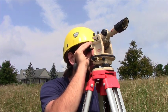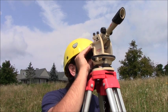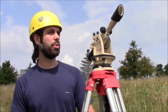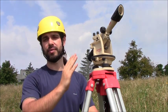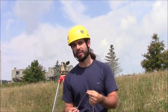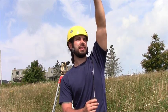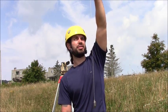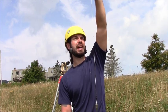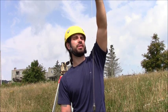At the 20-foot guy wire level, we're just a little bit off center past vertical, and the tower continues to move in that direction. So we're going to have to pull in some slack on our rear guy wires to pull the tower back into a vertical position. In a situation where you don't have a transit, you can use a plumb bob, which is basically just a weight on the bottom of a string. Set yourself up in line with the side guy wires, hold the plumb bob up, stabilize it at the bottom, and let it go — it pulls the string level to the ground. Lining it up with the base of the tower, we can see that our tower is just a little bit past vertical.